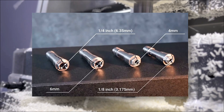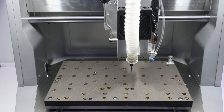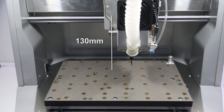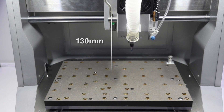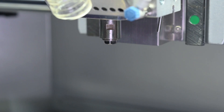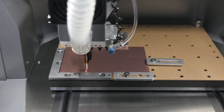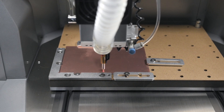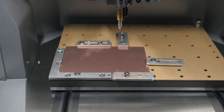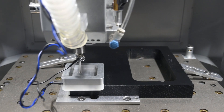This gives you the ability to use a wider range of tools, making the machine even more versatile. When it comes to the work area, you've got 300 by 200mm of space on the X and Y axis, and 130mm on the Z axis. If you're using the brackets and top clamps, the usable surface will be a little bit smaller, but it still gives you plenty of room for most projects. One of the standout features is the autoprobe, which handles automatic Z-axis calibration across multiple points on your workpiece. Using the wired laser probe not only helps with calibration but also gives you an outline of the work area, ensuring you're machining within the clamps and other fixtures. There's also a manual probe included to accurately find the origin on a workpiece.